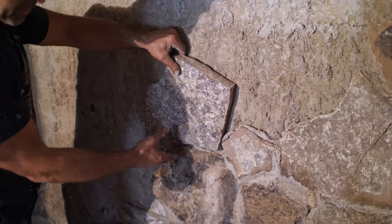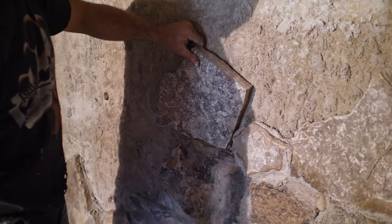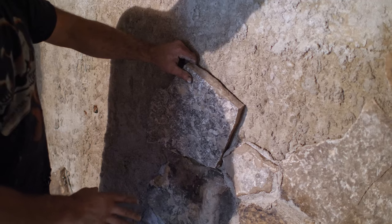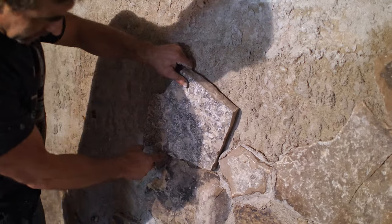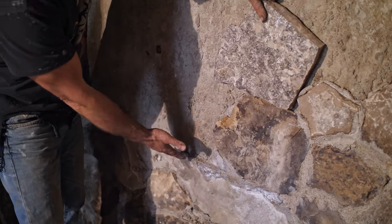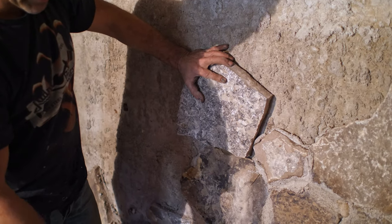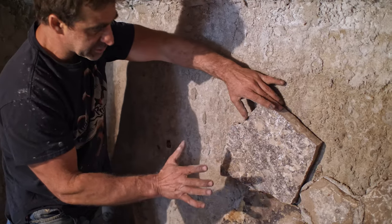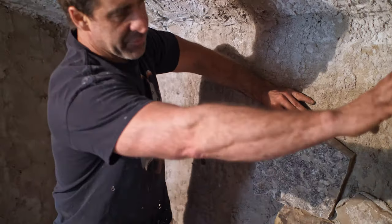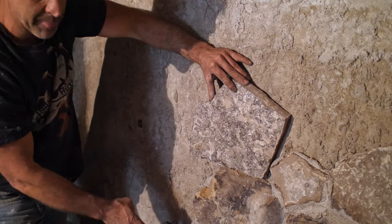I'm going to add this one here. I'm actually scraping the bottom of the barrel as far as stones go, and I'm hoping I have enough to finish. This is one of my last really nice ones, but this is a visually prime area so I'm ready to use it. It tees well off of this one here. Typically when I'm doing this, I build from the bottom up and actually lay stones on top of each other because I'm trying to get that dry-stacked look with pretty tight fitting joints. But the beauty of doing stone veneer is you can float stuff in space because it's basically glued to the wall, and then fill in after the fact.